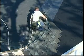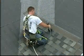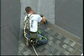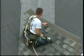Press the shingles tightly into the valley and use normal shingle fastening methods. Remember, no fastener should be within six inches of the valley centerline, and two fasteners should be placed at the end of each shingle crossing the valley.